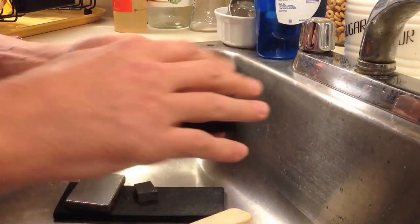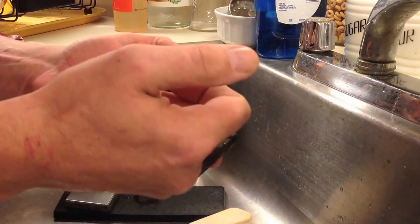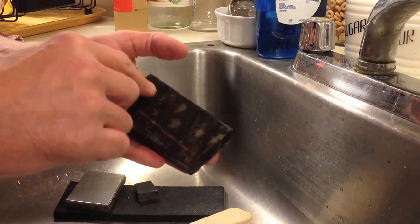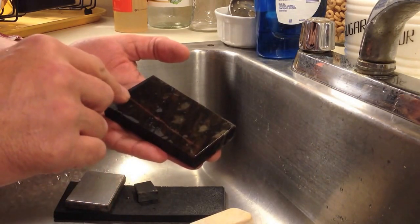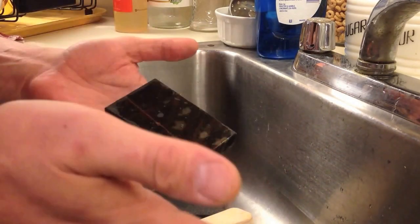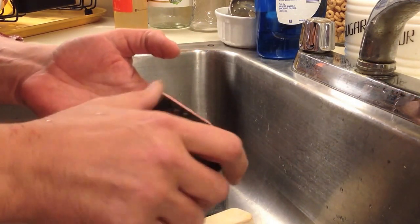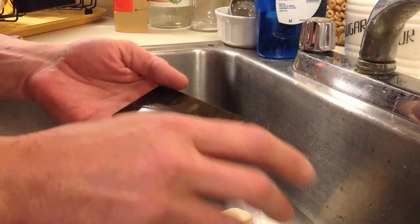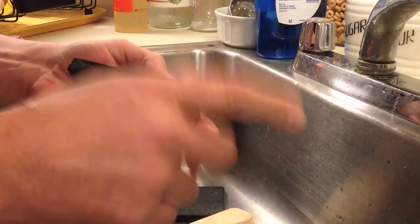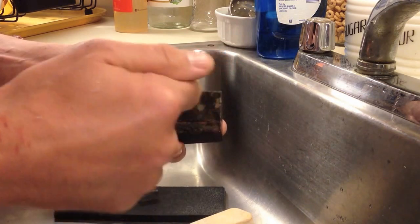Sometimes the surface on a jasper will polish unevenly and you wind up with uneven spots on your edge. Imagine this super hard stone becoming glazed in sections — not in a very uniform way. So your blade going over that, different surfaces act differently on different parts of the blade at different times — you just run into a problem. I tested some translucent chalcedony not too long ago — very nice stone, worked very well — but it still after a while gave me that weird polishing thing. This stone doesn't do that.